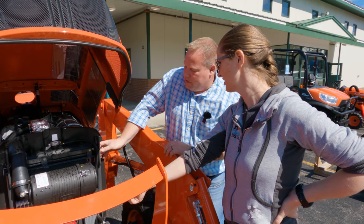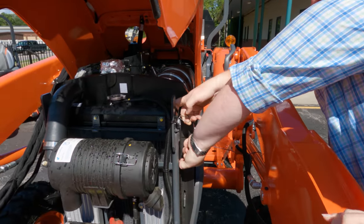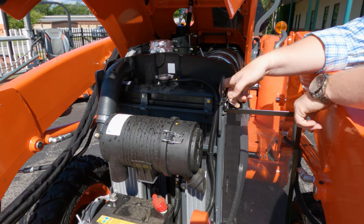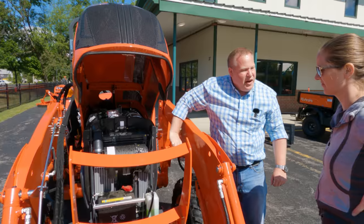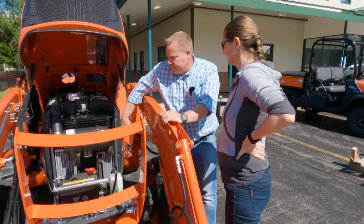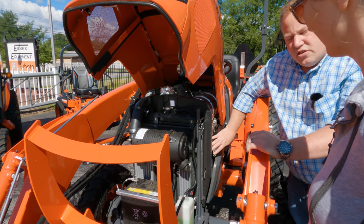To unlock the screen: lift this spring — it's better when the engine is cool — then pinch it and pull it out. Slide it back in and let the spring lock it so it can't vibrate out. Your alternator is right here on the side. These plastic shrouds do come off if you want to get closer to your engine.